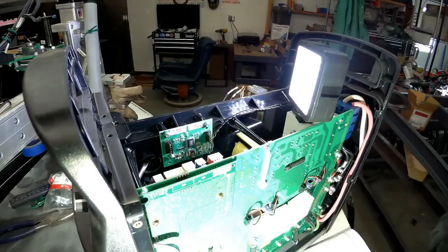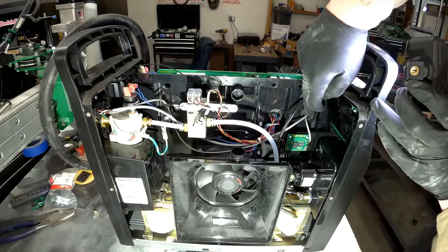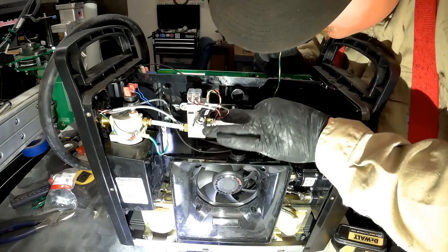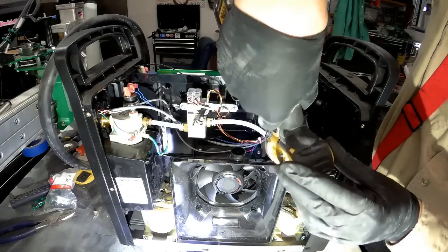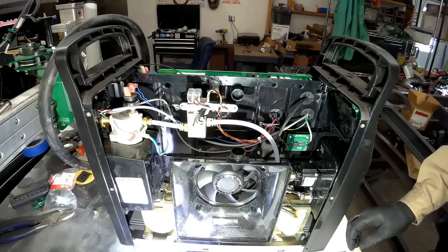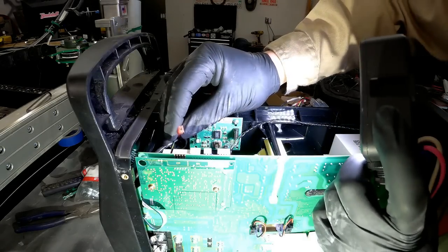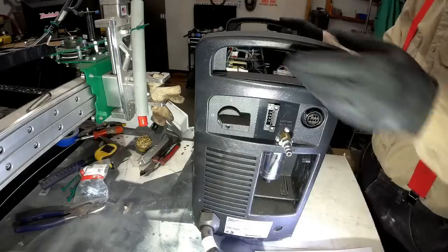Pretty straightforward — you just need one of those tiny screwdrivers. There's a torque rating in the manual, but I just got them snug. Now, flipped over on the other side, we need to ground this thing out. There's a bolt exposed down there and we need to wire the ground through that lower right-hand hole. Line it up from the user's manual — the green and yellow ground cable — get that bolt lined back up and tighten it back down. Then stuff it in that gasket in the hole on the bottom right-hand side, which pops out to where we just screwed the board. There's a little plug on there; there's a picture in the instruction manual. Go ahead and plug it in on the board and now you're grounded out and can connect the rest of the stuff.